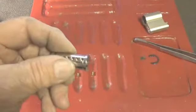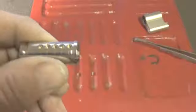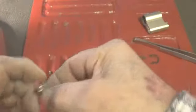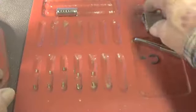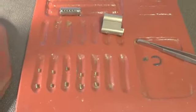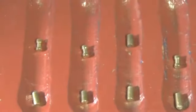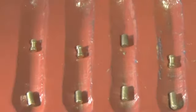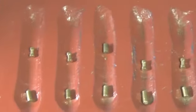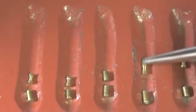This is just standard from the factory — all five pins are working. Nothing changed about the plug or the bible. You have a standard pin on the bottom on all five, and the driver pins are: spool, spool, standard, spool, and a spool.